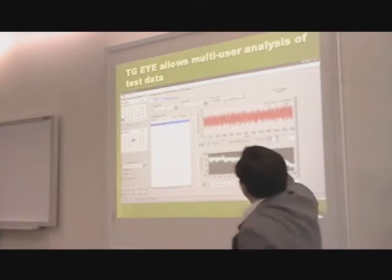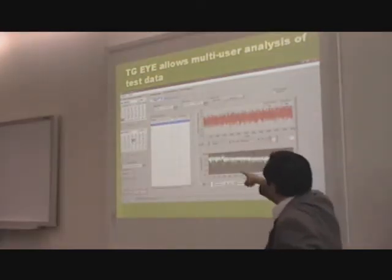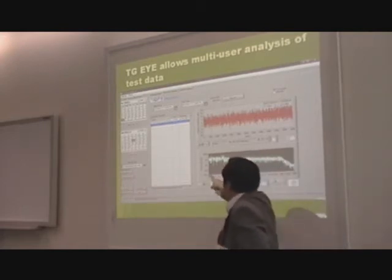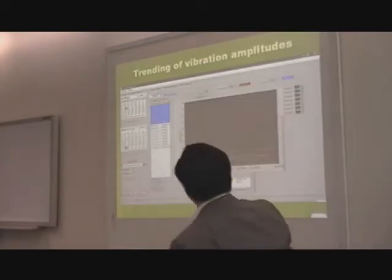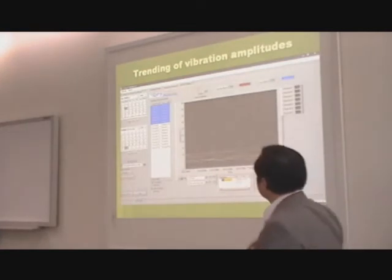So you can see long-term time domain signal and also the Fourier transform. In this case, it's clear, 100 Hertz, 2 times the Indian line frequency of 50. So now it's very clear. Now, this is the real value of our solution.